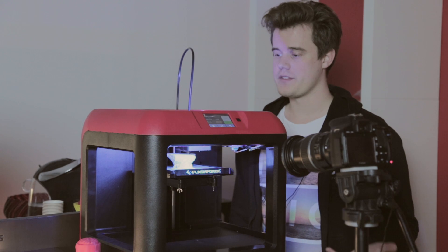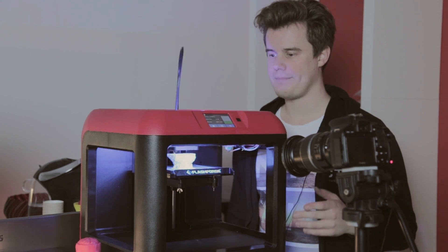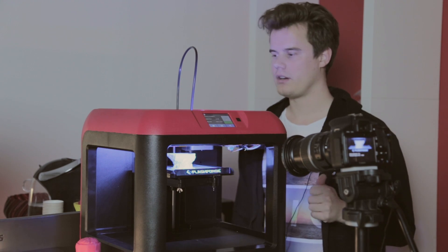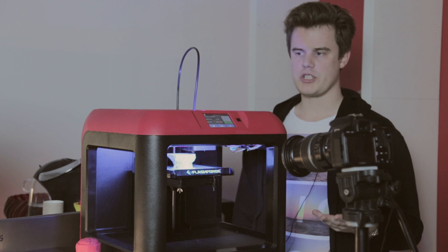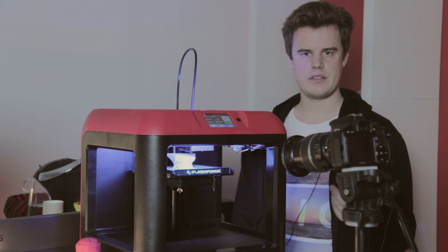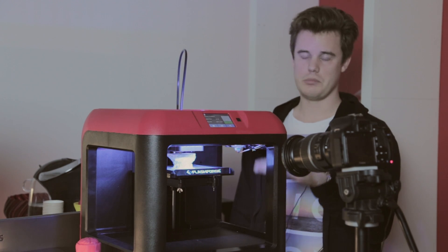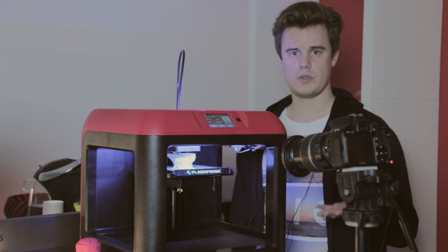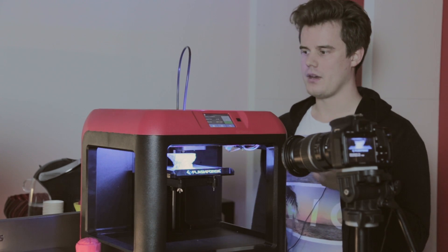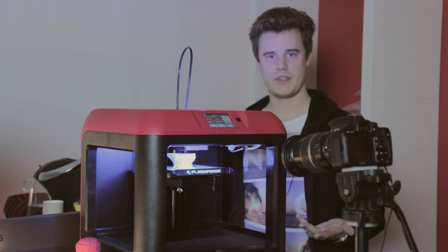Thank you very much for watching. As you can see, I'm talking next to the printer and just behind the camera you have another printer going. It's printing a really cool timelapse right now, so you should see that in a few days in the print series. To summarize: the machine is very quiet, easy to use, and it's printing really really well. The only thing to note is you have to keep the build plate clean — the blue painters tape or the built-in build tack needs to be clean, otherwise the model will start to lift. I'm currently trying the third filament type, the MakerBot PLA. I've also used eSUN PLA and FlashForge PLA, and everything works really really well. That's all — thank you for watching, bye!